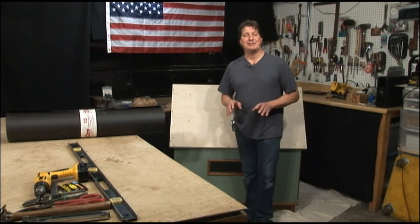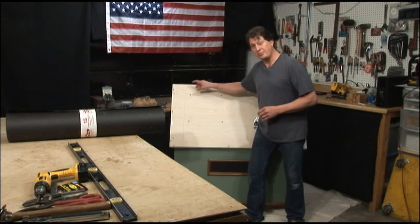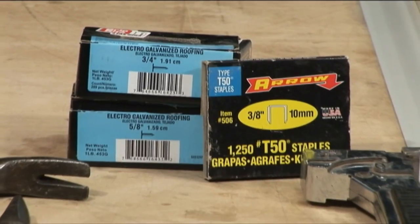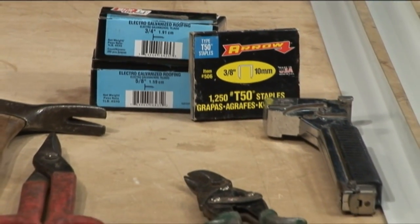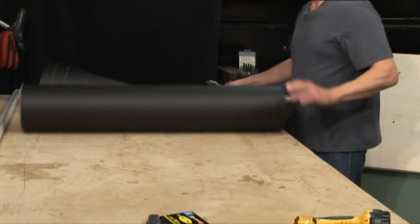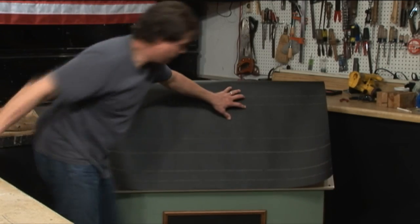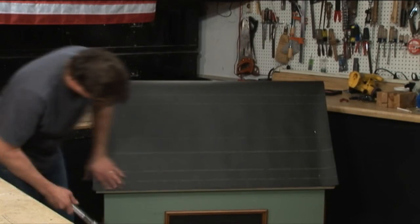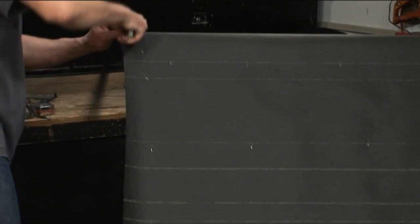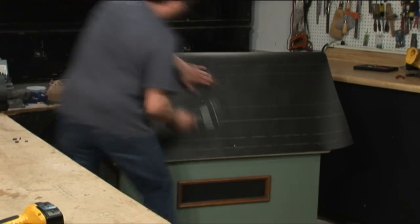We're now ready for our roofing application. We'll start with 15-pound felt paper — cut it wide, staple it on with ⅜-inch staples, and trim off the excess. Then come back with our drip edge to outline the whole perimeter of the roof. When starting your roofing project, make sure you have your ¾ and ⅝-inch roofing nails, ⅜-inch staples, a stapler, a hammer, tin snips, a razor blade, and a hook blade. Roll out your tar paper, cut it wider than your roof, let it overhang on both sides but flush it to the bottom. Put enough staples in so the tar paper doesn't go anywhere, then trim off the excess with your razor blade. Put the other piece of tar paper on the other side, flush it up to the bottom, make sure it overhangs, and staple it in.